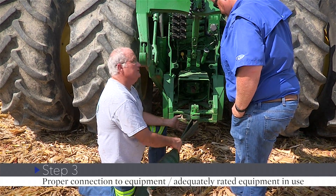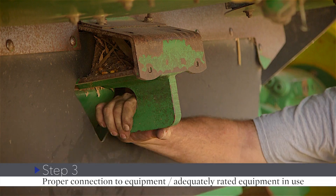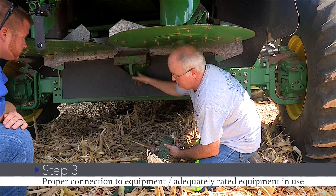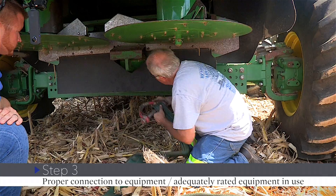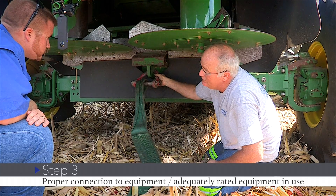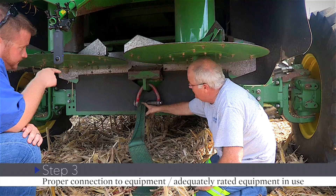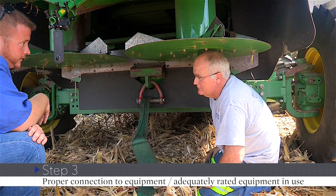The more pressure you put on it, the easier it's going to cut the strap. Previously, the strap was hooked right into a piece of metal with sharp edges on both sides. The harder you pull, the more stress it puts on the corners of the strap, and the more likely it is to break. Instead, just put a shackle in, hook straight up, and now you're pulling on a round piece, metal to metal — you don't have to worry about the strap getting cut. If a piece were to fail in the previous setup, it would fail right there at that sharp metal contact point, because the abrasion creates a break point.